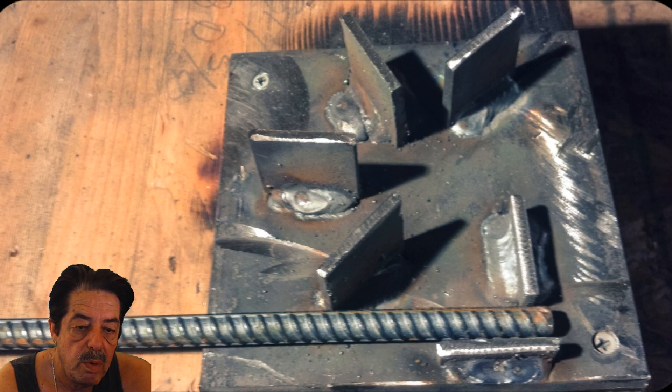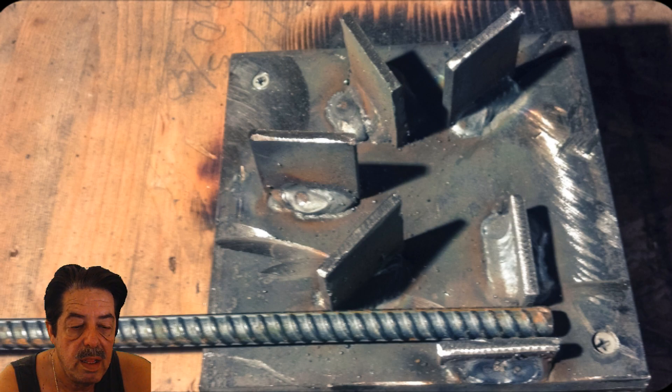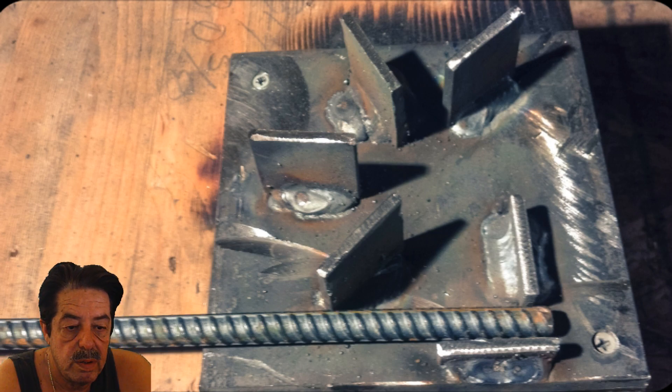Once done, we cooled it off and removed it. We used a four-and-a-half inch angle grinder with a cutoff wheel to cut it, then heated it and bent the two ends so they matched close together. We MIG welded it, then used a four-and-a-half inch angle grinder with a flap wheel to clean it up and make the weld look like it wasn't there.